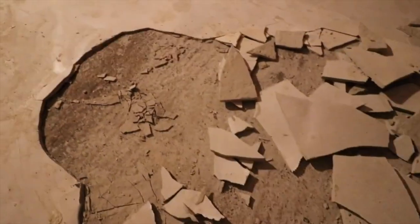Someone at work suggested that it was too cold, being 5 degrees. I'm pretty sure I mixed it correctly: 5 litres of water for a 25 kilogram bag. But I'll just show you the cracks that I'm talking about. As you can see, in the floor levelling compound, we're getting these cracks that are small, however, it means that I'm able to pull it up quite easily.